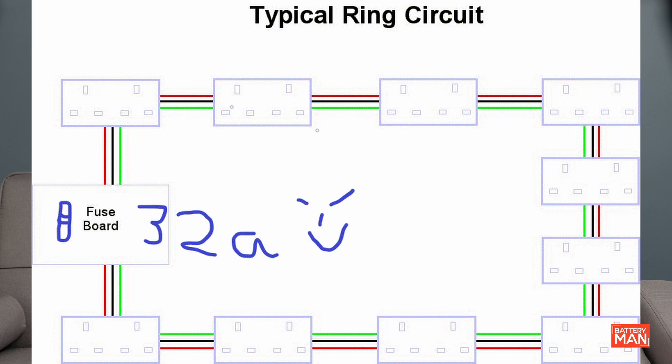For larger systems like ring mains — loops of wire that supply power to multiple devices like kettles, dishwashers, and washing machines — there's usually a 32-amp circuit breaker. In normal operation it won't cause issues, but if there's an excessive current situation, the circuit breaker will trip, protecting the wiring. The advantage of circuit breakers over fuses is that they're resettable, while fuses need to be replaced after they blow. This makes circuit breakers more convenient for everyday use.